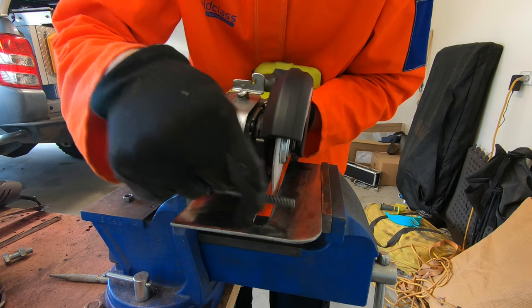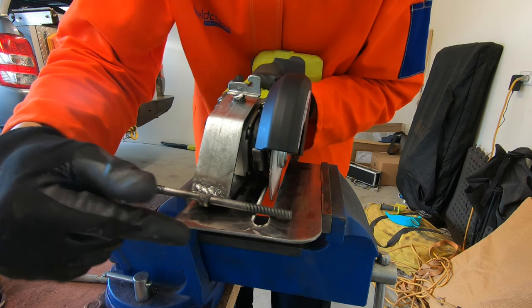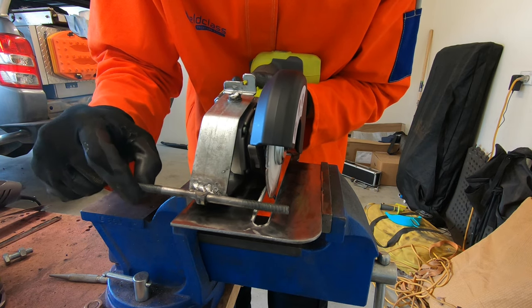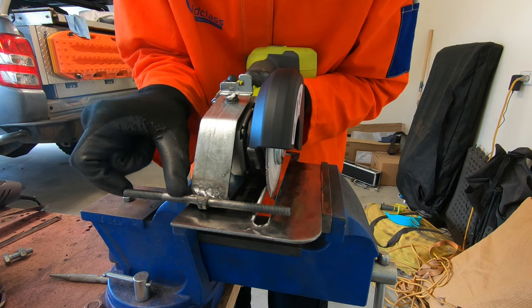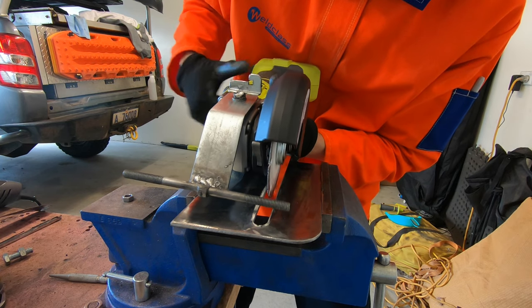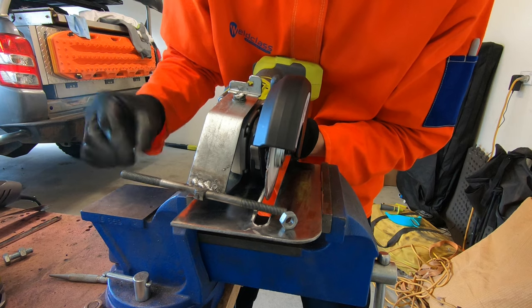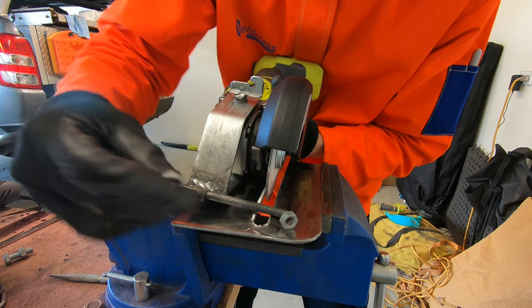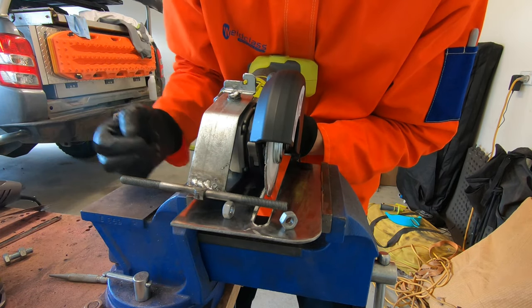So originally I designed the hinge to be this way, but now, obviously, the base plate is a little bit too short, so I cannot attach the nut onto this thread on here. So this part of the bolt becomes redundant, but that is fine because the solution is to put a nut in here, and I've rounded the thread of this nut, and I'll put it through this bolt and secure it over here.